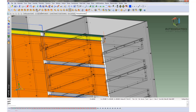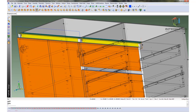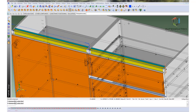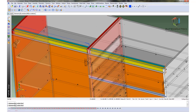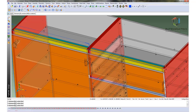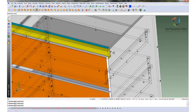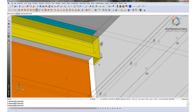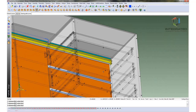Now we want to use our sawing feature to select the panels we are going to saw using the guide curve brought in with that element. So using our saw function, we are going to pick the lasso to pick multiple parts, then pick the four ends of the two cabinets — they all need to get sawed. We go OK and the sawing path is the curved line we brought in with that element. So now all four ends have been sawn to the shape of that curved element — all those ends have been shaped away so the pull will fit in very nicely.